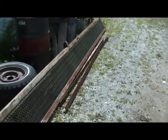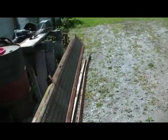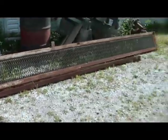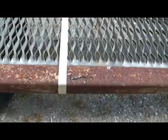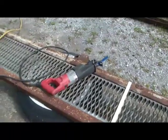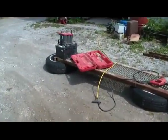I'm going to cut this in half and I've got two pieces of angle iron to weld onto the sides to square everything up and attach it to the trailer. You can see I've measured out the halfway mark and wrapped masking tape around it so I can get a nice clean cut. I'm cutting this with my Sawzall, suspended up off the ground with two tires and some old batteries as counterweights.